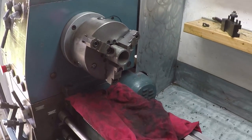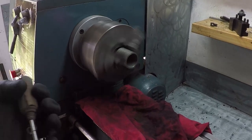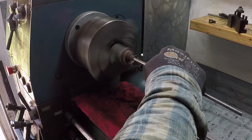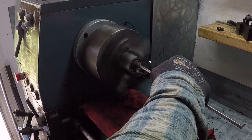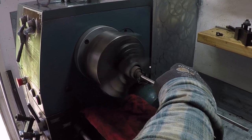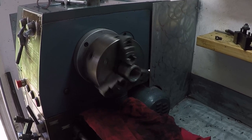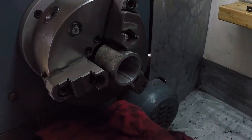It is safer to not wear gloves around rotating equipment. Wearing gloves, jewelry, long hair, loose clothing, or a long sleeve shirt can increase the chance of the operator being pulled into the rotating machine, resulting in severe injury or death. I'm very careful around operating rotating machinery, and I highly suggest you be safe. Any work you do, do it at your own risk and follow the highest standard in safety.